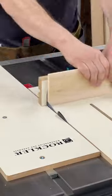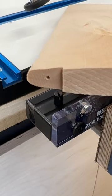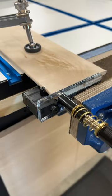I knocked these out real quick. Remember when I cut the notch in the end of all the louvers on the table saw? Well now we'll drill a small hole in that notch — like really small. This will be a pilot hole to mount the hidden control arm.